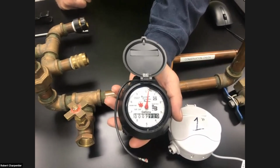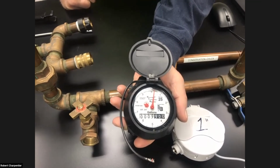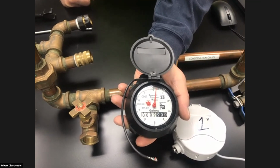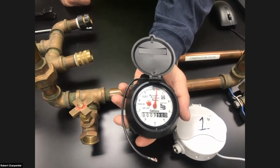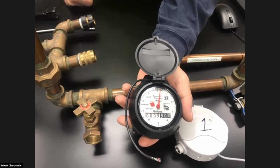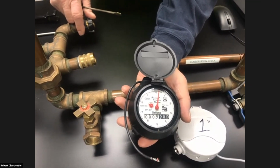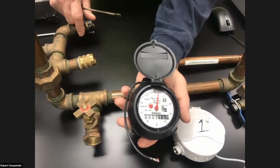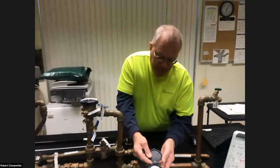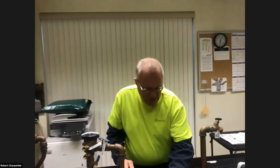If you've ruled out all of those possibilities, you may need to go to the supply valve, the shutoff valve again, and reoperate that, as sometimes you can get a little debris, a little grit, maybe some sand in there from the drain valve that will not allow it to seal up completely. So what you would do is just open and close it, even just slightly, enough to work any debris free, and then snug it down. Maybe try that two or three times. Many, many times that will resolve that problem, and that way you know you are good to go in your winterization.